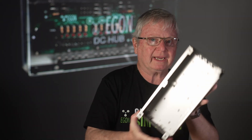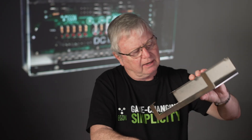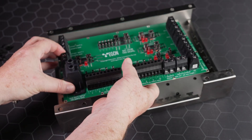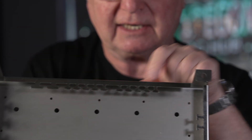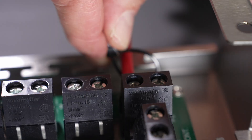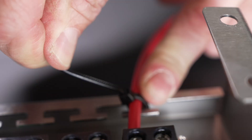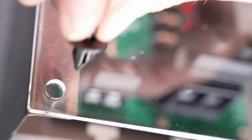The mounting bracket, which is optional, has a lot of cleverness in its design. We've deliberately left one side with no connections at all. You assemble the bracket — it sits in like that. These little T-sections, you can see them there: when you run your cables, you slip a cable tie over them and tighten it up. This prevents vibration wearing your connections loose.